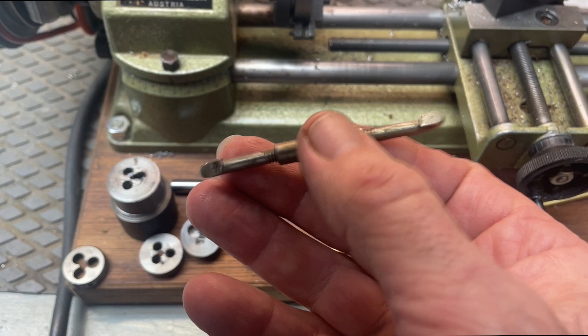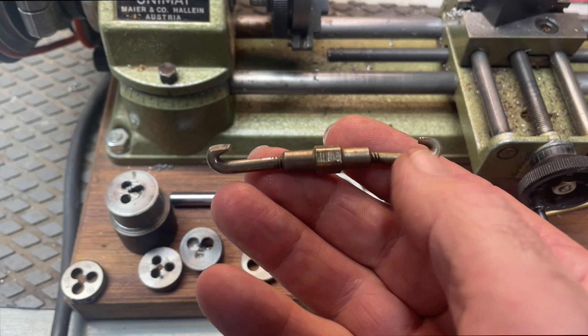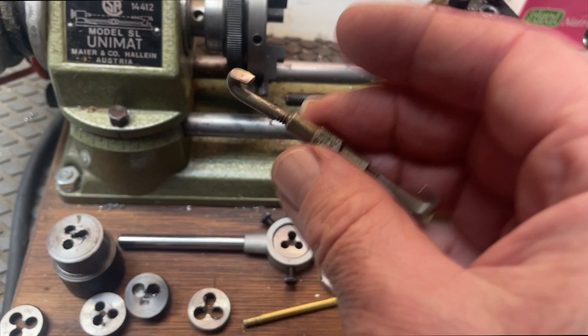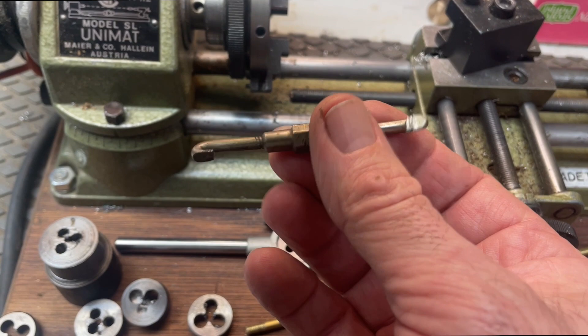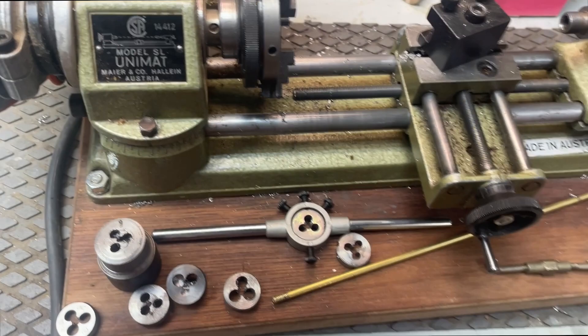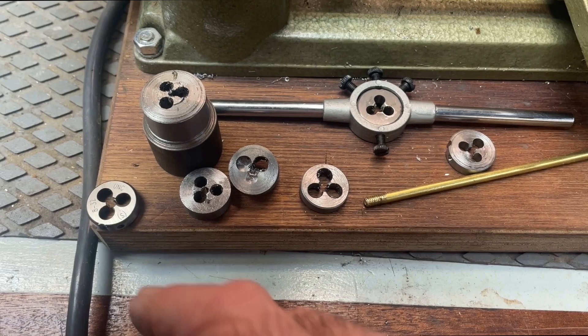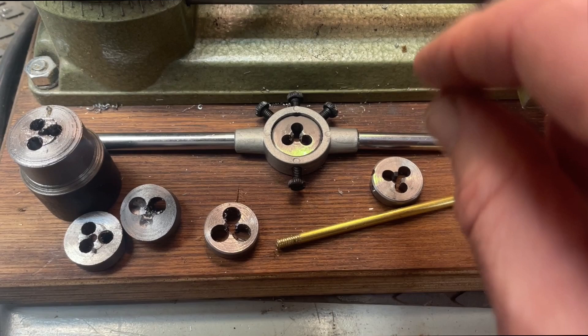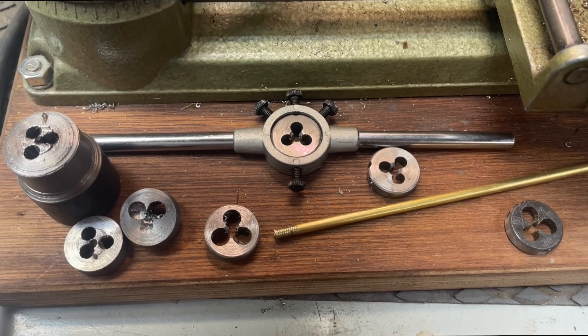The goal is to make some of this hardware — a little banjo pot tensioner turnbuckle. So it's right-hand threaded on one side, left-hand on the other. Getting taps and dies for the right-hand side, no problem. The same thread is like a British 8-26 or something weird like that, which I cannot find without going to specialty sources beyond McMaster-Carr. So I went with 8-32 since I don't really need to have them match anything or be interchangeable. While I can certainly get 8-32 right-hand taps and dies, no problem — left-hand is very considerably expensive. It's about 50 bucks for one die. The taps are still like 10 bucks a piece. So I decided to try making a die.